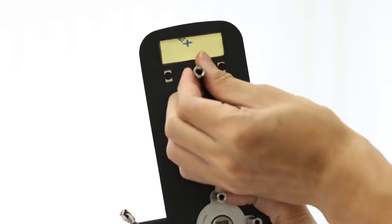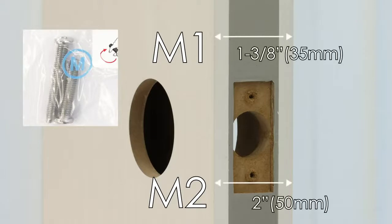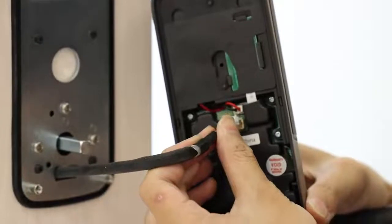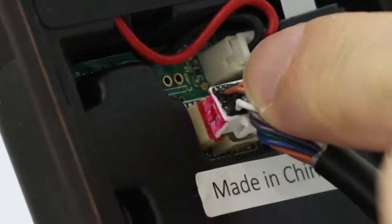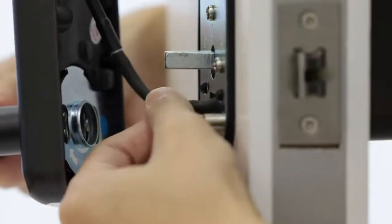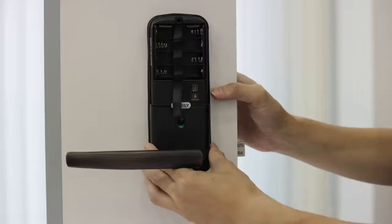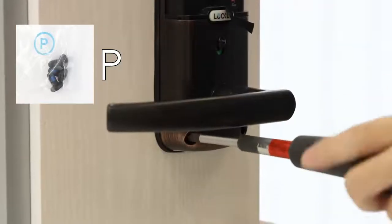If using fasteners to secure the upper part of the lock, select the appropriate optional screw, M1 or M2, depending on your door thickness. Finish securing the mounting plate to the door. Plug in the cable from the exterior assembly to the circuit board on the interior assembly N. Make sure that the plug is oriented correctly, matching the red side of the plug to the red side of the socket on the circuit board. Guide some of the excess length of the cable towards the exterior assembly. Position the remaining length of the cable away from the spindle area. Position the interior assembly, ensuring that the spindle fits into the square hole and the interior assembly sits securely on the mounting plate. Secure the interior assembly to the mounting plate using three screws P.